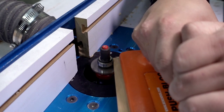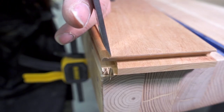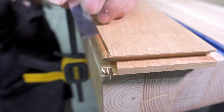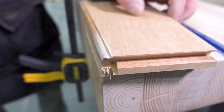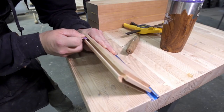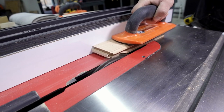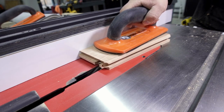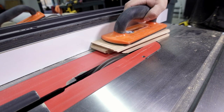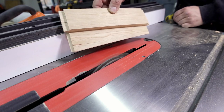On an inside curve, routing a profile sometimes leaves a little section that has to be chiseled and sanded. And I can't use the V groove on these curved pieces, so sanding will ease the edges. Then the back can be dadoed out because these doors will have glass, not a floating panel. And if this isn't making sense, I'll show you.